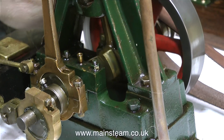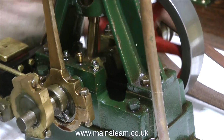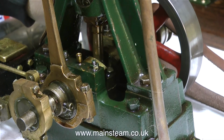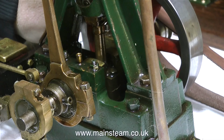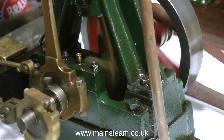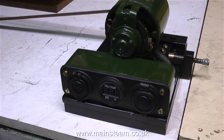That could prove dangerous. You only need sufficient compressed air so you can hear when the compressed air is admitted to the cylinder at each end of the stroke, and then make a fine adjustment of the eccentric's position so that the air is admitted just before the piston reaches top dead centre or bottom dead centre. This early admission is really desirable as it cushions all of the moving parts at each end of the stroke.